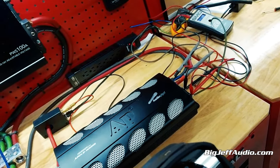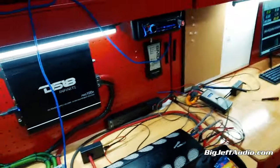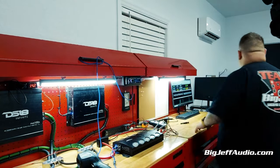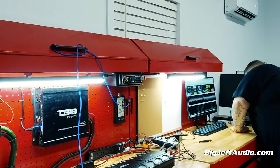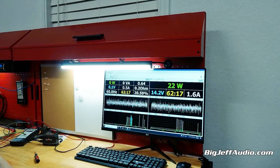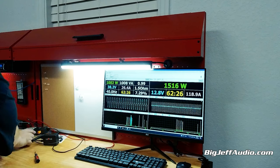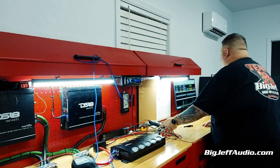You can see it is a little bit hotter than the stuff around it, but it's only really at 78 degrees. We just snapped a shot of it. You can see it's a little bit warm, but really not for the amount of times we keep hitting it. We're going to hit it again now — we set it at 1.3 ohms. We're about 1,000 watts, and we're getting about the same. It's pretty close to the SMD here. They were really close — that's a good sign.